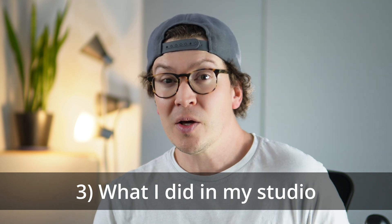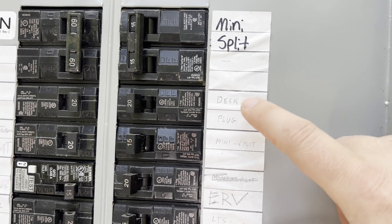I want to briefly talk about what I did in my studio. I took a four-gang outlet plug right at the front of my studio room and ran a home run — a direct line — straight back to the electrical panel on its own circuit breaker: a dedicated 15-amp fuse and wire carrying all the electrical for my audio equipment. I plugged my interface, computer, and everything related to audio into that single circuit, so I wouldn't get interference from my lights and HVAC. This is a good approach, and you should do it if you can't do star grounding. But it's not exactly a star grounding system and still has some problems with it.